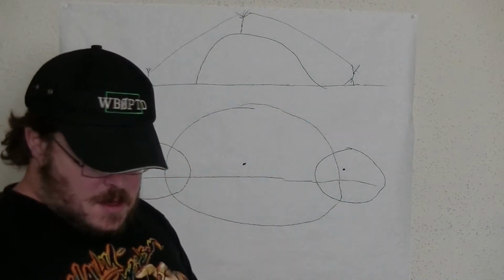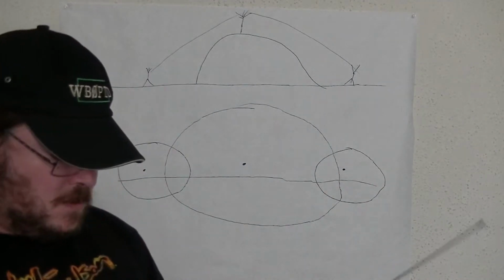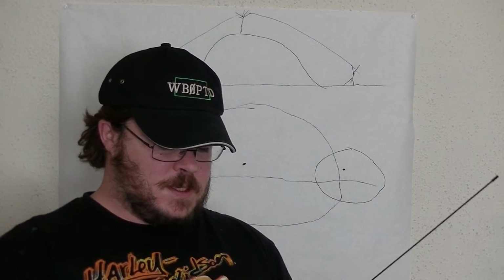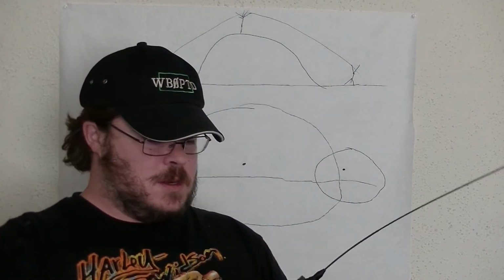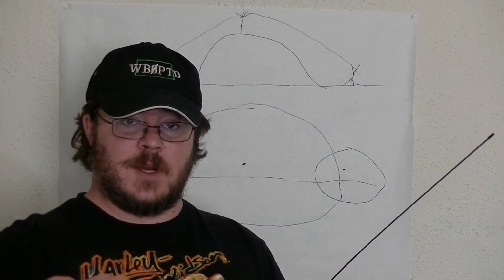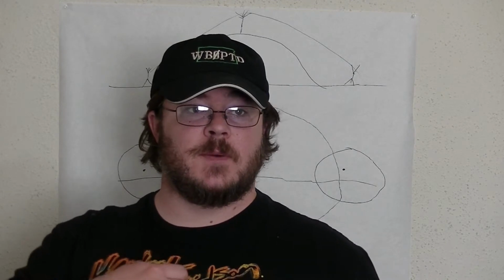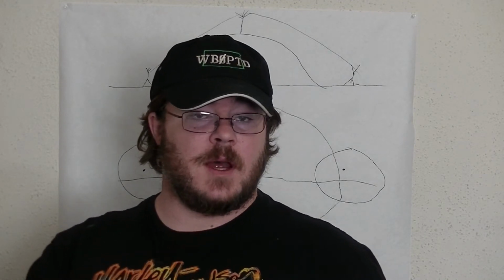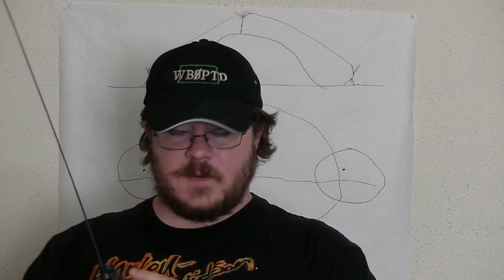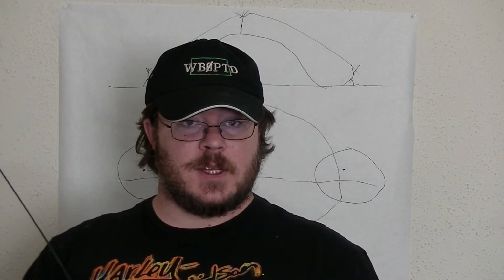Now what's happening is when you set up your radio, if you want to use a repeater, you have to set your radio up for what they call duplex. Now, what happens is when you hit the push to talk button, your radio automatically transmits at a different frequency from what it receives. So, for instance, the repeater that I own, the frequency is 443.125. That's the received frequency, and that's what your radio is going to have displayed on the display.